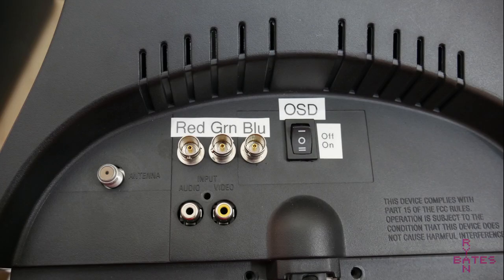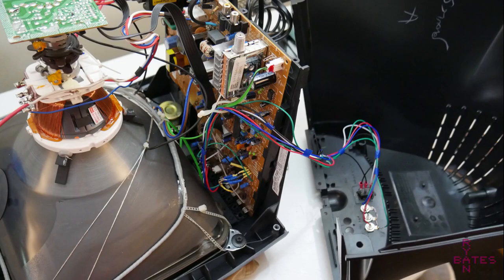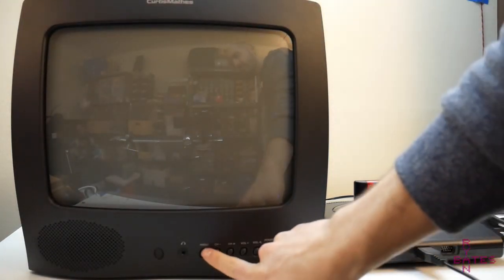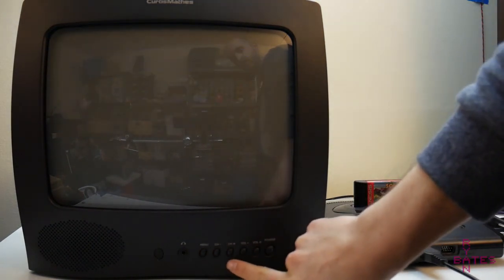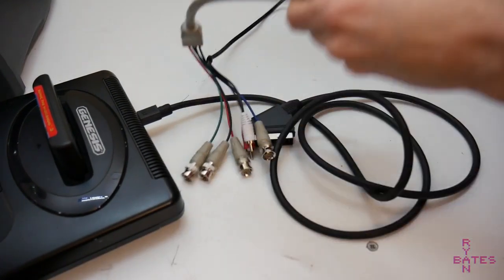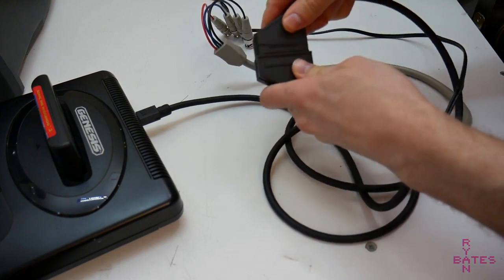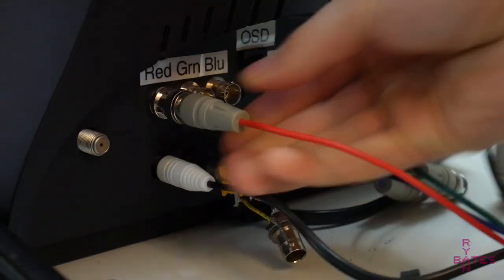I'll add some labels so I know what to connect here. I wrangled these wires a bit before closing everything up, and I'm going to test using a Sega Genesis model 2. The Sega Genesis natively outputs RGB — we just need the right cables to get that sweet RGB goodness, and this is where the mod gets a bit pricey. I need a Genesis model 2 RGB SCART cable and a SCART to RGB plus sync BNC cable. I'd avoid the cheap cables if you're going down this RGB hole of video signal elitism.